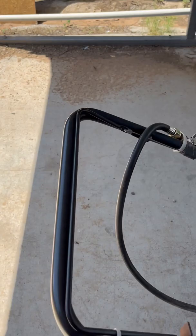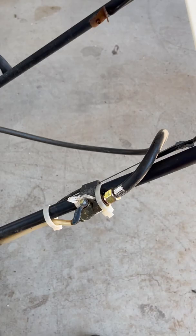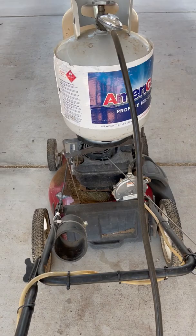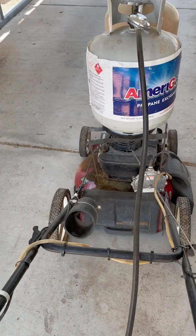To give you an idea how this all works — I'll turn on the propane here. I open up my valve full blast, now I'm going over to my ball valve and open it full blast. Now I'm going to hit this primer button about two times, then come here and partially close my ball valve. As you can see, it runs great.